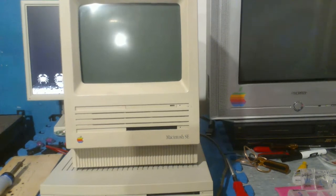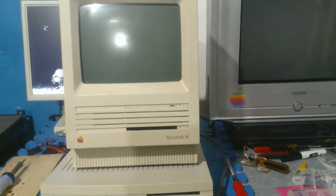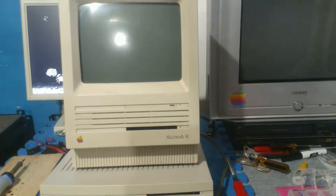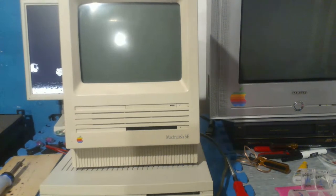As long as you discharge it correctly, it's fine. Bruce's channel's got a great tutorial about it. Yep, pretty cool. And a tutorial video on his channel. Yeah, Bruce has a lot of very good content on his channel about how to discharge stuff. If you want to discharge a CRT, I recommend checking it out. I already know how to discharge a CRT, I just never have the reason to do it. You just have to get a flat tip, connect it to ground, and then put it under the suction cup, and then it should be discharged. But usually they discharge themselves, but it's better, rather safe than dead.